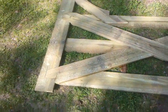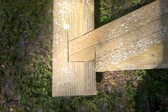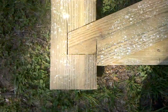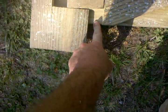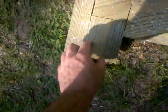This is part of the second layer of the 3-ply fence. You can see the joints that I've created here. Again, they're a little overcut. You could elect to take the Sawzall out and cut them perfectly, but it's not that important. This has a 1.5 inch lap here just to hold this little part that hangs down. This will be glued and screwed.